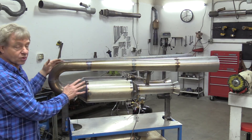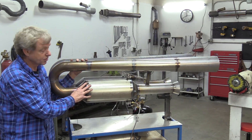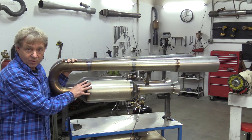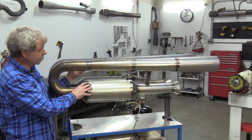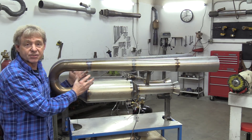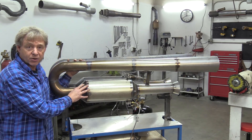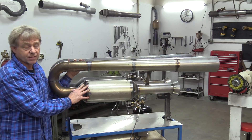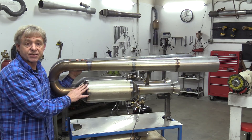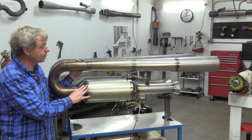As you can see, all it is is two 50 pound thrust viper engines, but I've cut a hole in them in the middle and welded them together, and they run as a single engine. There are four little one-inch holes between them and it equalizes the pressure in the combustion chamber. Now because it's diesel powered, you can't start it on diesel — you have to start it on propane and then turn on the diesel. You can't just blow air in it or anything to start diesel; it just won't start.